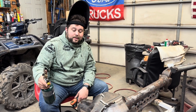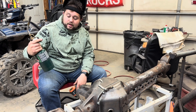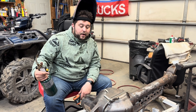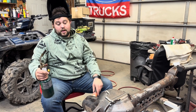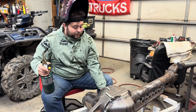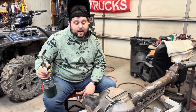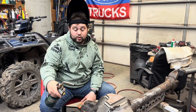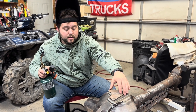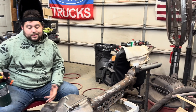You know what, if I have it all sitting here, I might as well get it done and put it under the truck before the wheeling season starts. So the time is now. What I'm going to be doing right now is heating up this cast — this has to get to about 400 degrees. I probably should get the acetylene torch out, but we're going to try to do it with this and then hopefully the welder will keep us where we need to be. We want to be 400 degrees on the cast, keep it up to a higher amperage, and weld this down. Once it's welded on the outside, I have this little piece of armor plate that goes on top. I'm going to weld that down and then take off the front cover, take out the ring I have installed, and weld this all from underneath because it needs to be oil tight.